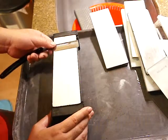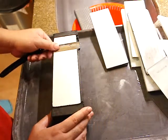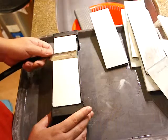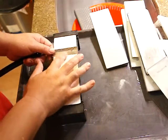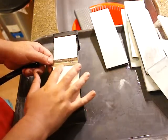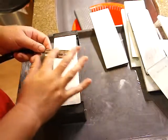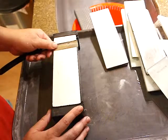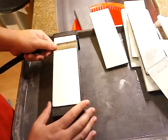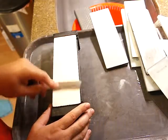You can sharpen in a zigzag or any direction. But if you try to sharpen with the blade edge leading, the blade edge sharpens more. If you sharpen the other way, the shoulder wears more. So if you don't want to wear the shoulder, moving forward toward the blade edge side is the better way to sharpen, then return the other way.